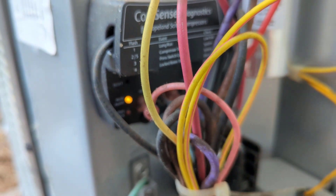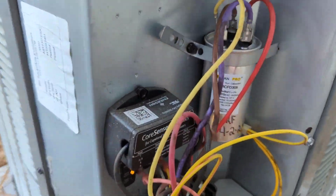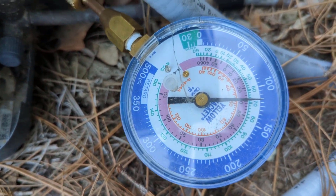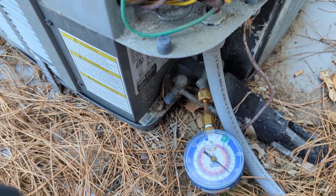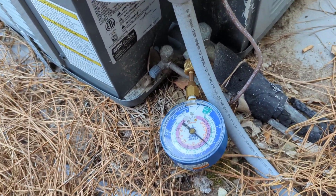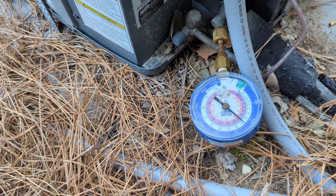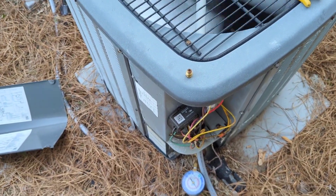We got our solid yellow light on run, which is good. The unit's been running for about 10 minutes. Got my initials and date on the cap, and we got the stub gauge on. You can see we're a little over 115 psi on the suction side — it's not low. It's only about 67 degrees out, so there was never an issue with it not cooling properly until today when it stopped working, obviously because of the cap. Just a quick check of the charge to make sure it's not low — that's it for this one. Thanks for watching, and we'll see you on the next one.